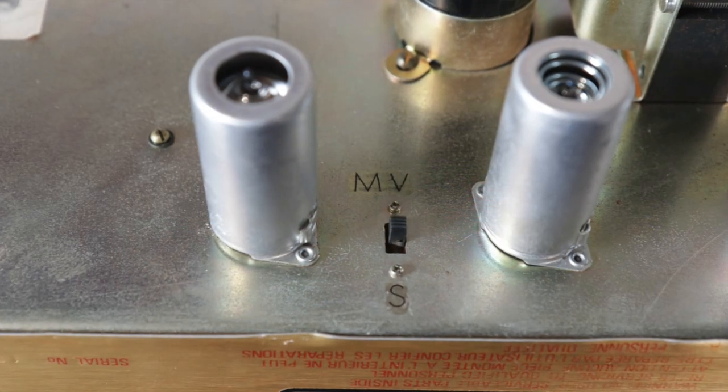It's quite useful. The amp also had, on top of the chassis at the rear, a selectable gain stage bypass switch, and I detailed this in the part one video, if you want to have a look at that. I've reused that as a second gain stage cathode bypass, so again, you'll hear it. Think of that like a structure switch on the Friedman, where you can select the overall gaininess of the amp.